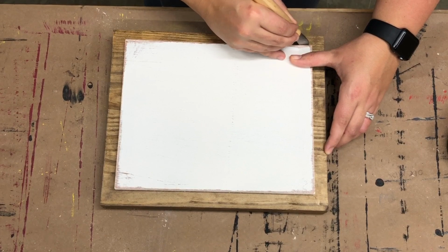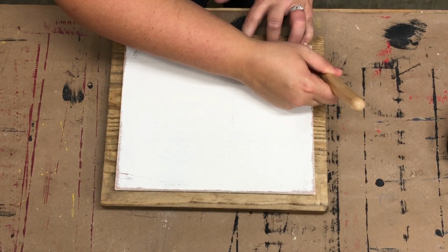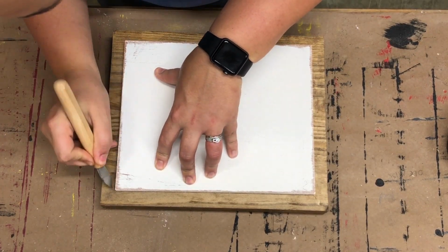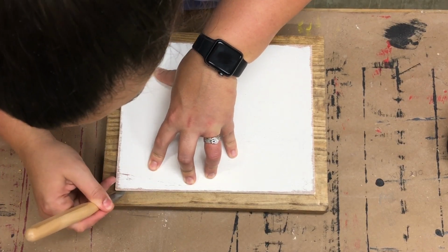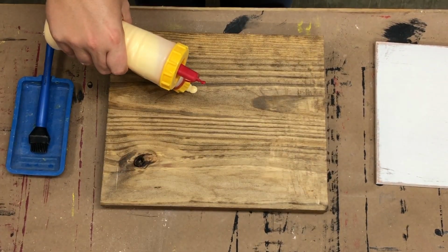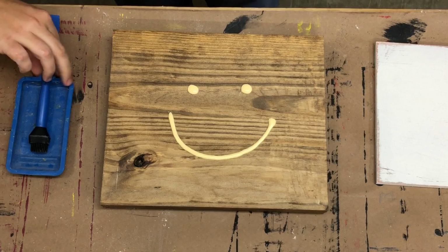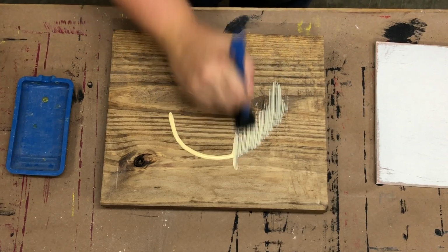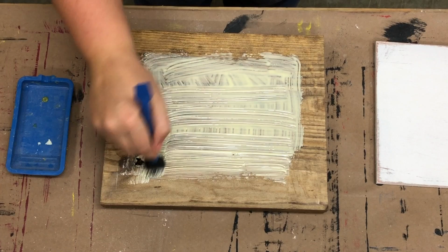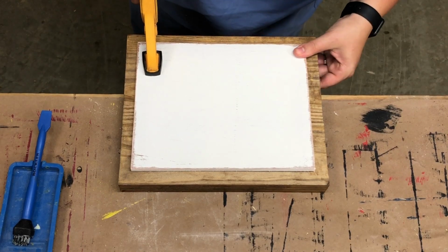In order to make sure we got the proper placement of the fascia board when it went back onto the backer board, we used a marking gauge to mark 2 diagonal corners. Then it was time for some glue. As we were spreading the glue, we made sure to stay well within our end marks to prevent squeeze out. We then set the fascia board down and clamped it into place.